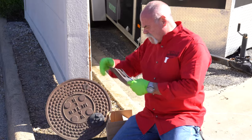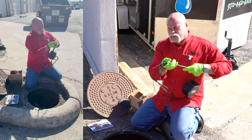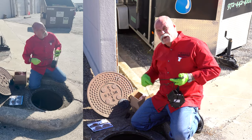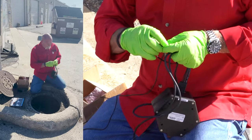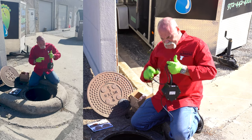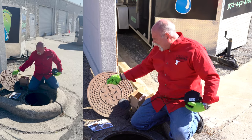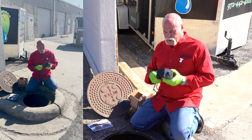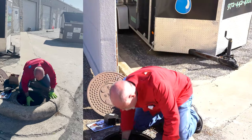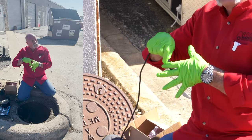This is actually a commercial water meter. I've got the directions right here. What I'm going to do is take the Meter Dog device and unstrap the cables. You've got three different cables coming off. You've got the big head on the end — this is the antenna, the cellular antenna that's going to reach up to the cloud to communicate with the server. You also have a waterproof device here, and I always check to make sure this is snug because this is what ties into the remote relay to actually control a valve. And then your third device is the sensor. The register sticks up high, and that's where the magnet's found. So we're literally going to put this on the side of the meter and zip tie it.